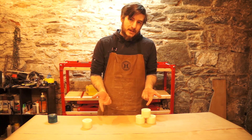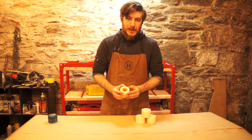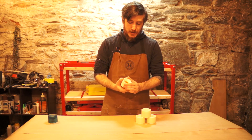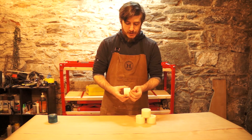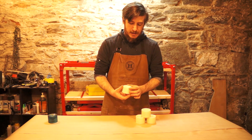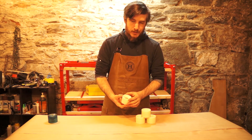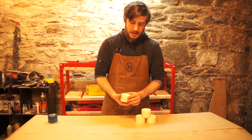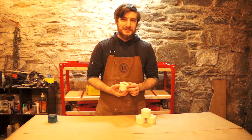So there you have it — a full set of solid 3D printed wheels. The material I used for the hubs is Polymaker's Polymax PLA — it's an impact-treated, reinforced PLA with a little more structural integrity than standard PLA. The material for the wheel itself is a generic TPU, 95A on the Shore hardness scale. For my tastes that's a little hard — I like to ride in the low 80s — but for the printer I have, this is about as soft as I could get. If you had a printer with a direct drive extruder or a Flexion extruder, you'd be able to get filaments down into the lower durometers, the low 90s and high 80s range. All that's left to do is put some bearings in them, put them on the board, and see how they ride.